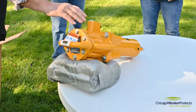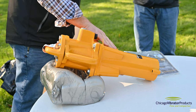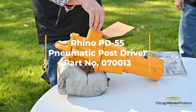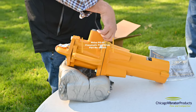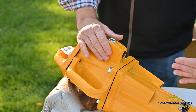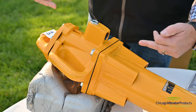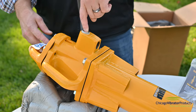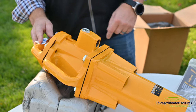We make everything in the US — we weld all this together, manufacture all this, cut the tube. When we hook up our air to it, you see we've got two inlets. We only use this inlet. The reason is you want all your fittings to go in line with the impact. If you were to put it in the other inlet, it would work but it would eventually wobble and break because this is going up and down all the time.